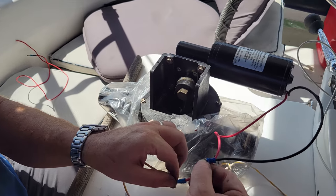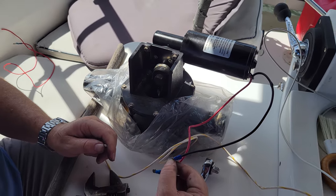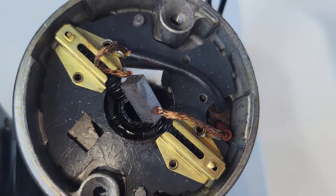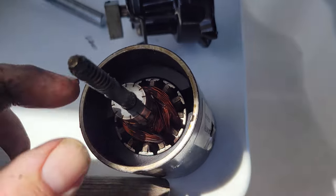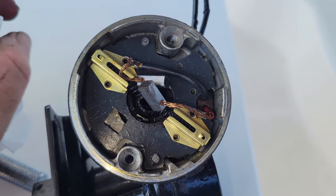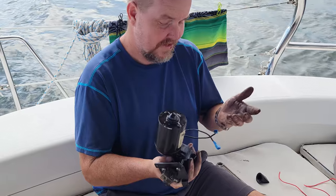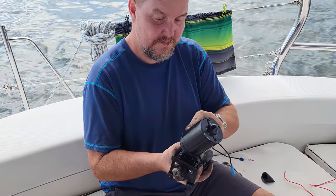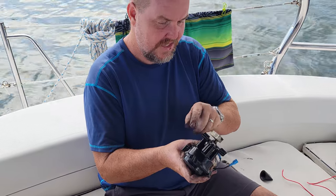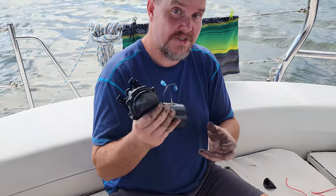What I'm going to try to do is cannibalize the other pump motor that I saved and see if I can fix this. I took the old motor apart and the parts look fine. I was able to spin it after I got the parts out. I just have to get these contactors back in - they've got springs. We tore down this motor and it was hung up, so we actually fixed this one. There's a tension screw to adjust the gears and I loosened that up - this thing is going to be a lot quieter. This is the original pump I should have fixed in the first place - saved us $250.